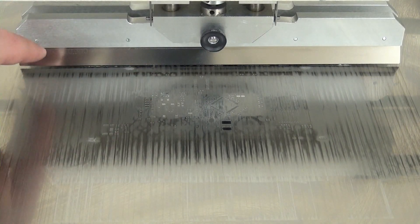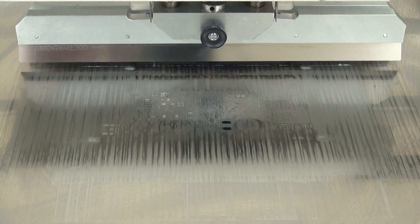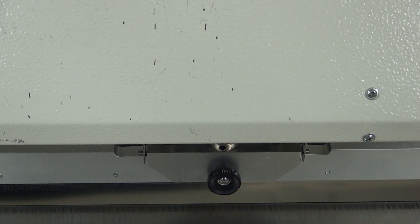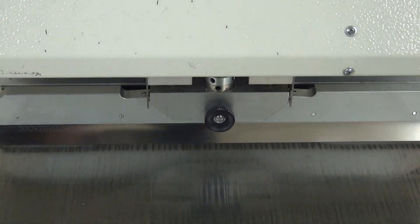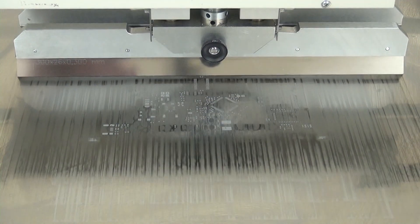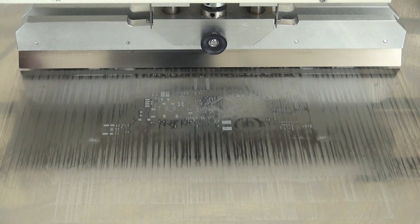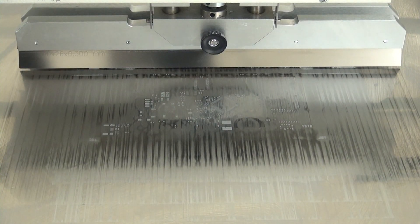There's some solder in the little wedge of the blades behind there. To get this actually coated, what we do is bring the blade back, make sure it comes back enough to actually cover the entire board, and then reverse. A little more. What I always do is take a nice visual inspection.